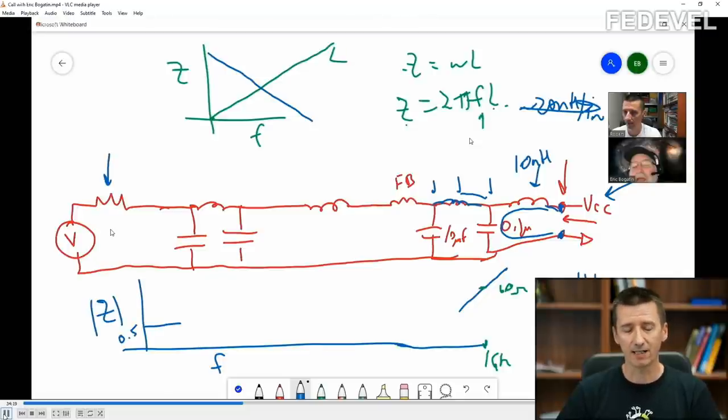And the third very big mistake what I have been doing was that I really underestimated influence of the inductance of the tracks. I always thought like there is just 5 millimeters of a track. Who cares how this can influence the power delivery? However, even very short track has inductance, and this inductance can influence the power delivery a lot.